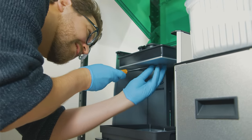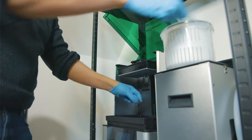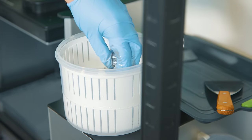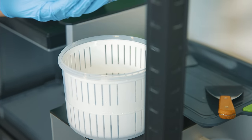On the flip side, resin printing is much easier and faster to dial in all the settings and get amazing and perfect results for your machine and resin combo. But the whole process of working with resin is far messier, and this is mostly because once your models are printed, you then need to do a whole cleaning and curing process to remove any residual resin and harden the shell. Throughout this, you must not touch the liquid resin with bare hands because it's toxic, as are many of the chemicals you use to clean the models with.